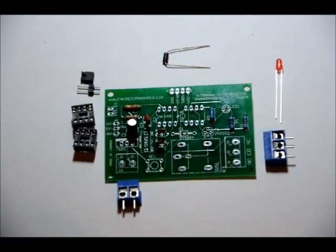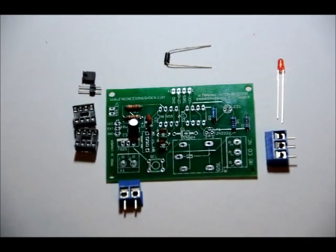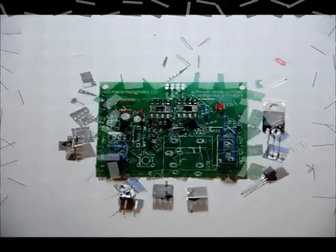If you turn that around, as soon as your relay is activated, it'll cause a short and it will reset your system. So the relay will never even go off if you have that backwards. Be very careful. Solder those all into place, and next we will do our transistor, our switch, we'll place our ICs in, and we'll do our 7805, and lastly, after that, we'll do our regulator, and then our ultrasonic transmitter.